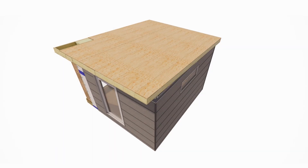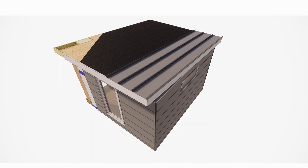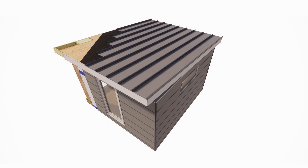The top side or exterior of the panels is sheathed with ½-inch plywood. Once the panels are screwed in place, Modern Shed's standard underlayment of water and ice shield is put down. On top of the underlayment, finishing the roof is new raised Select Plus 26-gauge Snap-Lock Standing Seam Metal Roofing and Trim Flashing, providing a 40-year warranty.